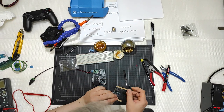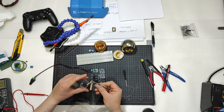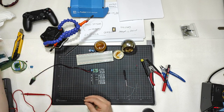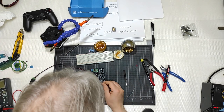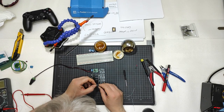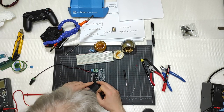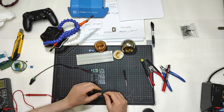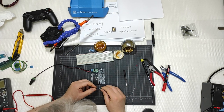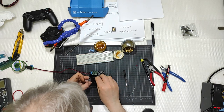10 kilo ohms. So they are right at 10 kilo ohms. I will need 1, 2, and 3 of them. Those are small resistors, a quarter of a watt, but they will be more than enough, especially because I will not use the whole sensor for now. They have no plus and minus, no positive and negative. I simply try to place them always with the same colors.